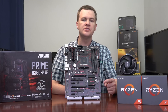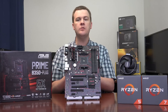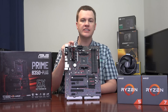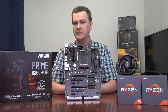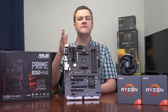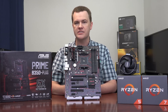At the bottom you'll see four SATA ports, plus two more on the side — six total. The B350 chipset by itself only supports four SATA ports, but this motherboard has an extra chip to provide two more. Most B350 boards don't do that. The Realtek 800 series sound chip is isolated — there is a trace on the motherboard physically isolating the audio chip from the rest of the board to reduce noise and interference.